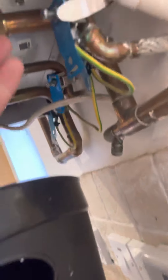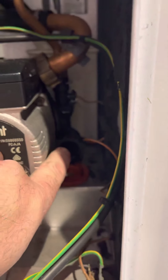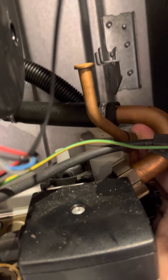That then lets you drain them two down into a bucket. You then go in there and pull that clip off your blow-off, which fits on there. You undo that nut underneath, which pulls that thing down there — as you can see with your finger there. You pull that down, the new blow-off obviously pushes back in there, push your clip back down, tighten your 15mm nut underneath, push your new expansion vessel in there, tighten your nut back up under there.